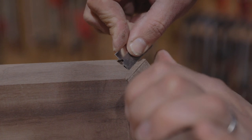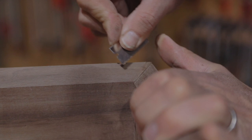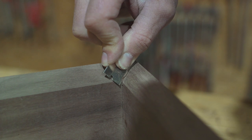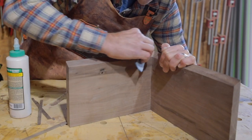Typically, working with the inside miter joint like this, it's really difficult to take down that proud surface to meet up perfectly with the other miter. I'm going to take a razor blade, which really gives me the control to shave away just as much as I want, and then from there take a piece of sandpaper and feather it back to where I want it to be.